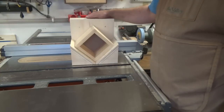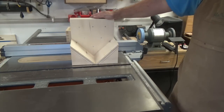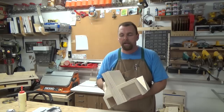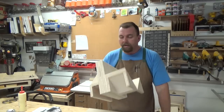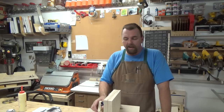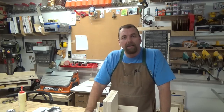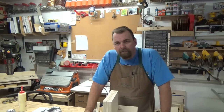Our picture frame spline jig has turned into a pretty swanky box jig. From a really cool picture frame spline jig to a multi-purpose box spline jig - it doesn't get any better than that. Give it a try yourself, make yourself one if you feel so inclined. Just remember: keep checking these angles, make sure you've got 45 and 90 at the base - 45 plus 45 totals 90 at the bottom. Thanks again for watching and I'll see you next week with another woodworking video.